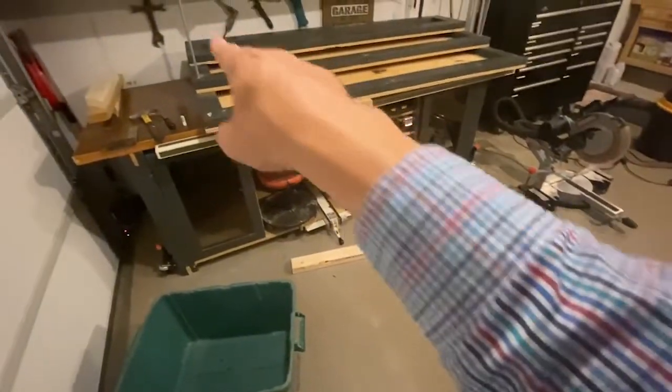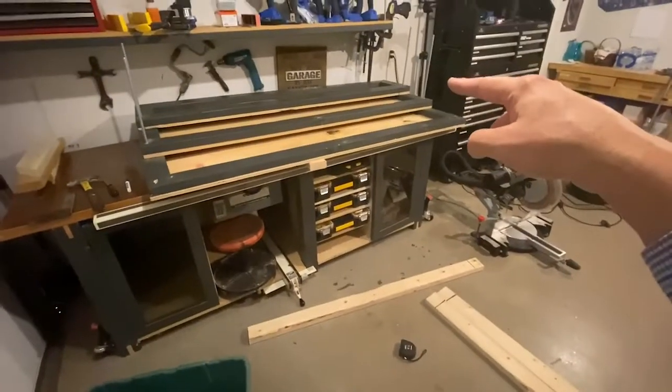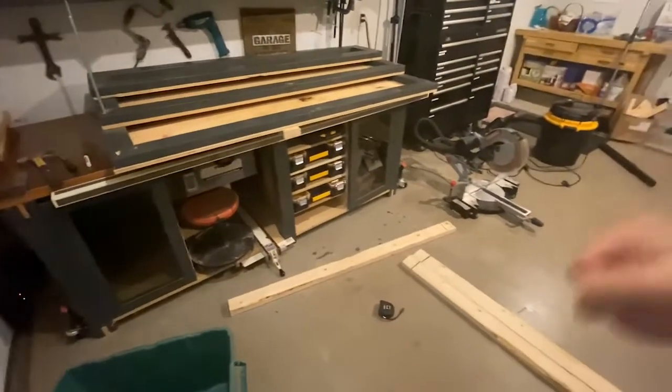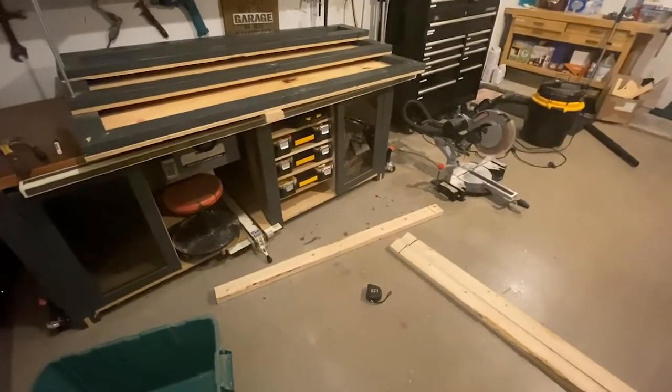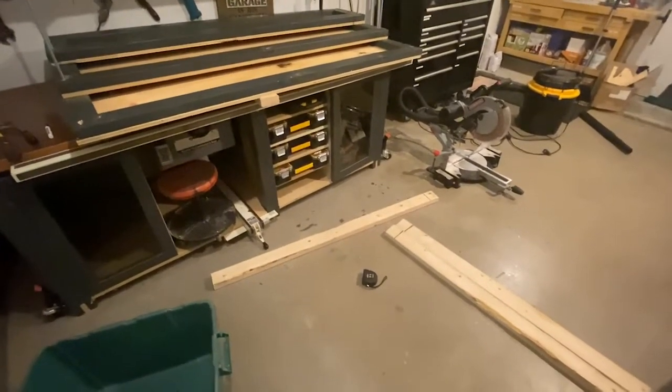And so the back of the shelves will be right at that mark. And then, since everything's lined up here, I'm just going to drill down, not all the way through, or I'll drill into my workbench, but drill enough to mark these 2x4s. And then I'll pull them out and drill all the way through, and it'll give me perfect placement then.